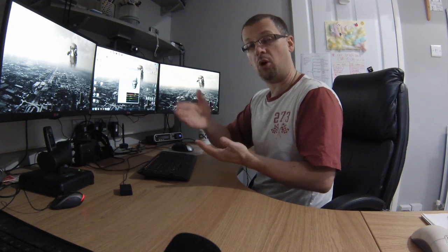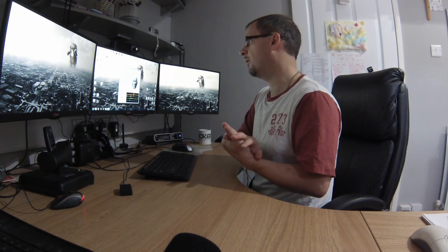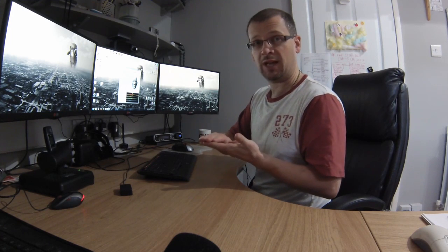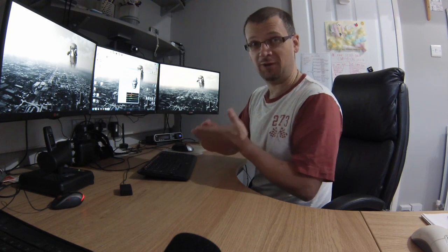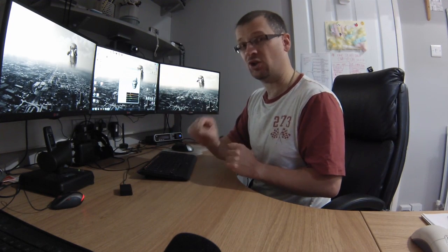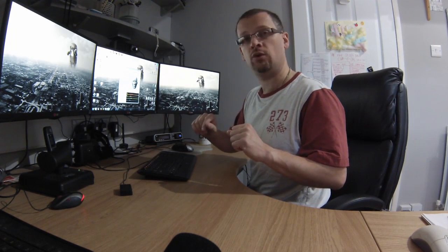And what the EDTracker will do is monitor that, store it, and then apply that correction over time so that you hopefully reduce that drift down. Now you can see it's very critical when we do this that the temperature is stable, but also that you don't move the device. So the device is flat and I am not going to move it. If you knock it just one iota, start again, because the device is very sensitive. So we're not going to sit here for 5 minutes watching that. Come back in 5 minutes after it's monitored that yaw drift. So see you in a second.